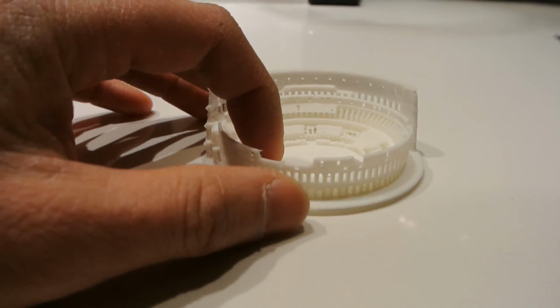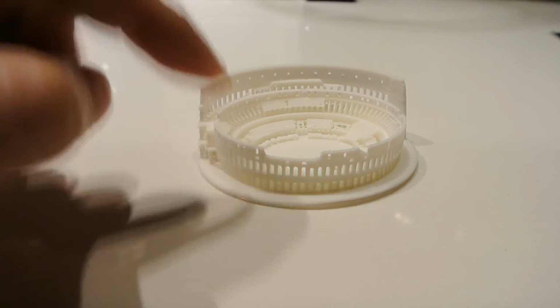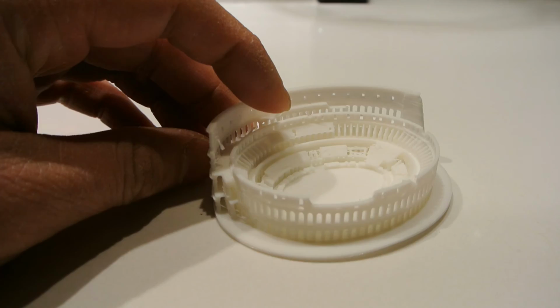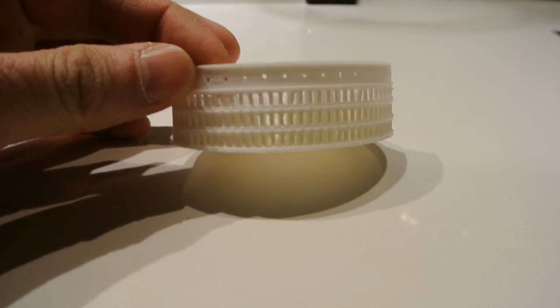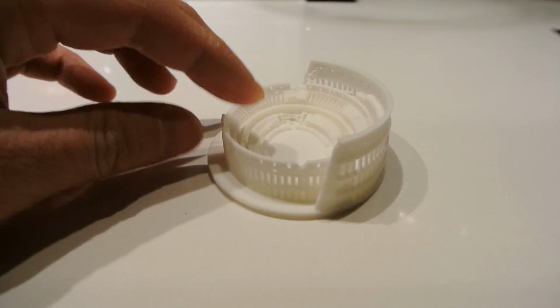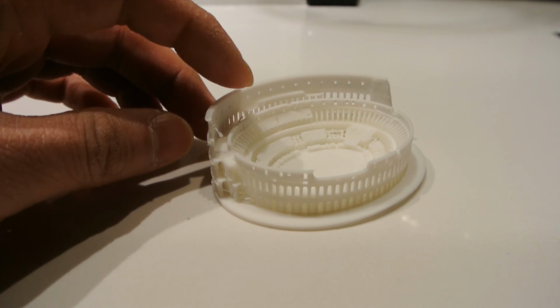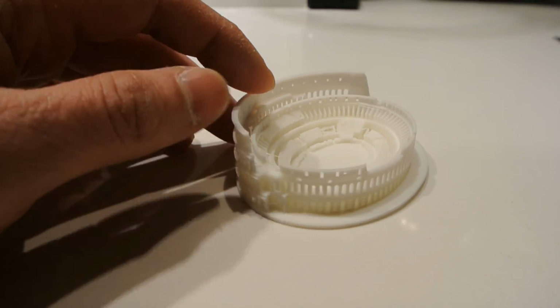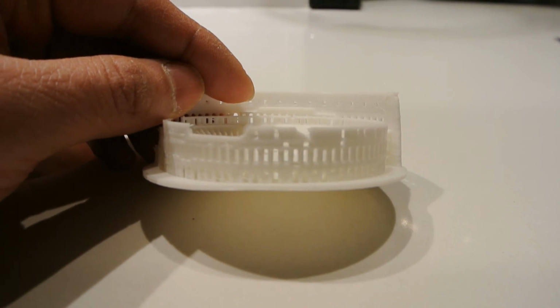So I had a little bit of warpage. I lifted off the bed a little bit, but overall it came out really well. I think they also say to clean the print bed with some acetone, so I might do that just to make sure to clean off any fingerprints or grease from my hands. So, okay, just wanted to add that at the end here.